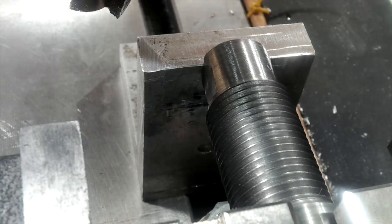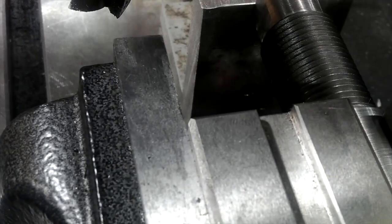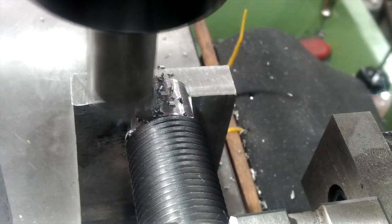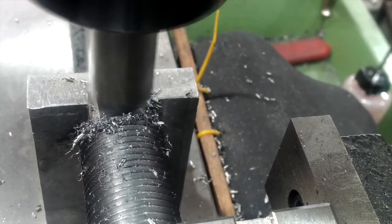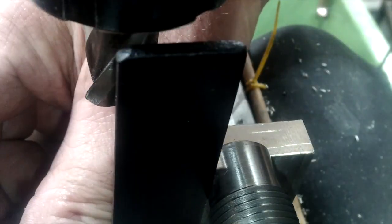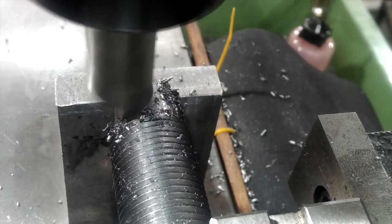I plunged down 3mm or thereabouts in the hopes of producing a 5/8 across the flat square peg. Needless to say, it was successful, but my problem was that I had to get a square peg, and the only choice I got was really to face off on the top when finished, rotate it through 90 degrees against a set square, clamp it up and do the same operation again another 3 times, and there hopefully end up with a nice square peg. It wasn't too bad.